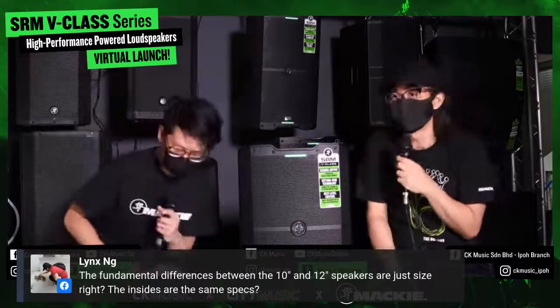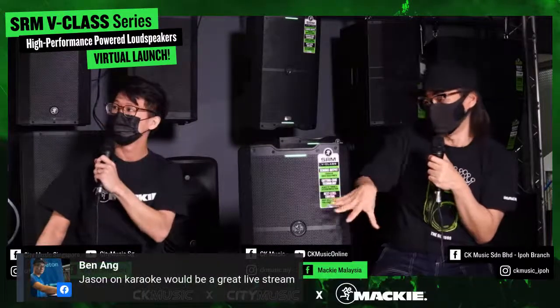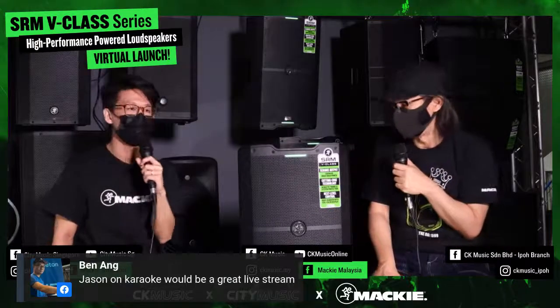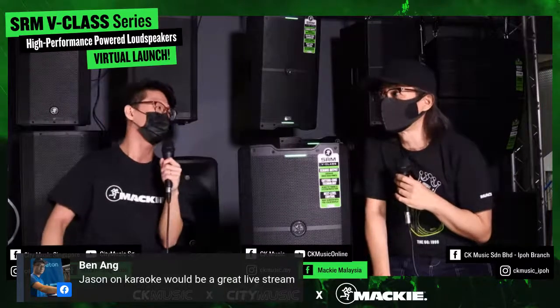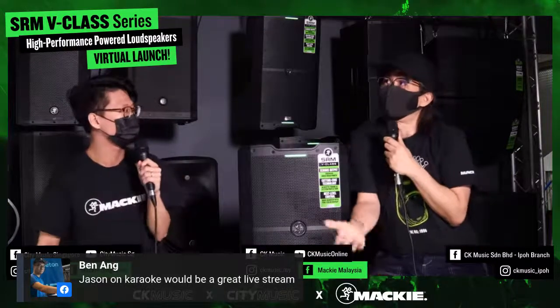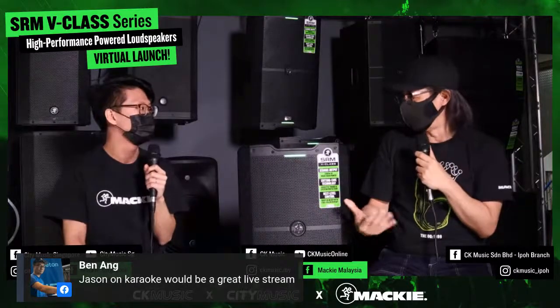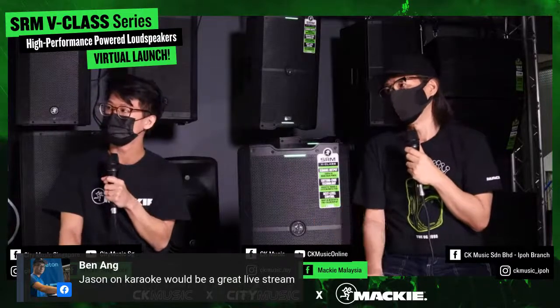Yep, I can confirm. So the bigger your driver is, the deeper you get down, which might be required for different kinds of applications. If you're using it for stage, you might not want that much low frequency on stage, so you might want it to be a bit higher.